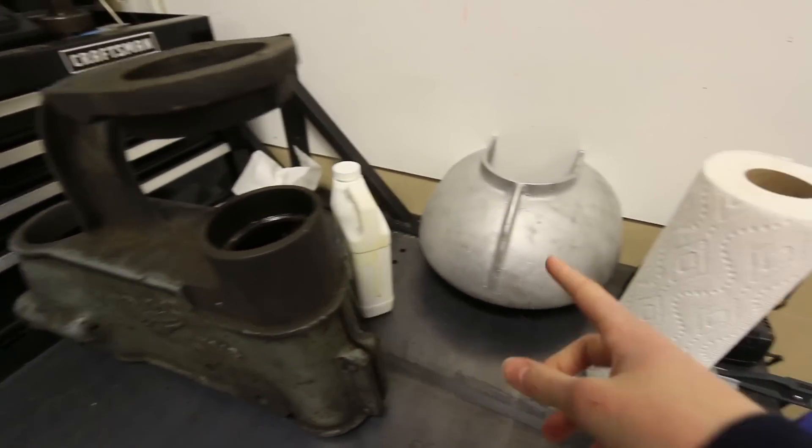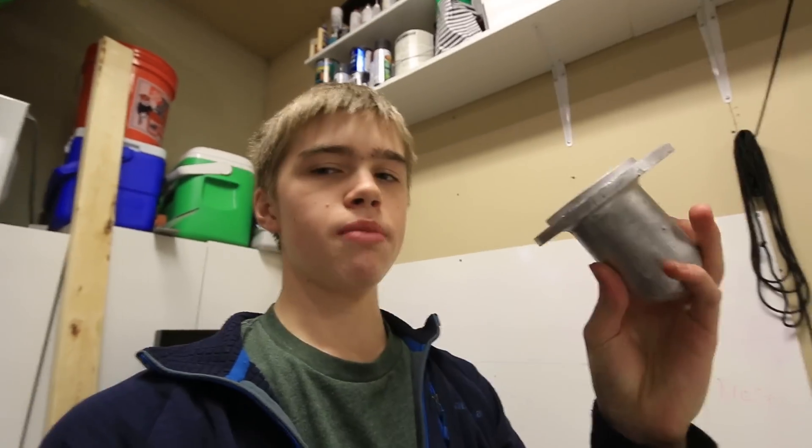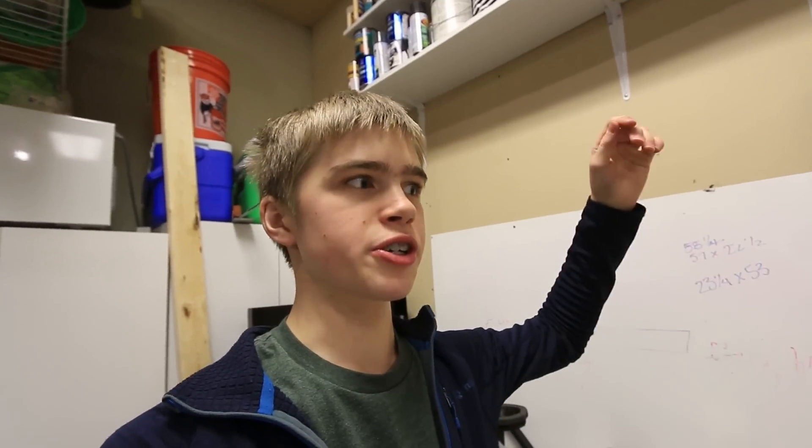I want to get a can of paint from Subaru. The paint color is either blue pearl or lapis blue pearl — I can't tell the difference. I want to paint all of the drill press parts, like the casting, the pulley guard, and all that, one of those two colors. But first I need to fill in all the holes and make it look half decent, and that is why I bought the spray gun — to paint it. The first thing to do is strip the paint off the parts, but I can't do that in the garage because it'll gas out the garage. I might wait till it's warmer out. So since I can't do that, I am going to make a beautiful pink sculpture out of this thing with a ton of Bondo. I want to make this incredibly smooth and excessively nice looking. Let's make some sculptures out of Bondo.